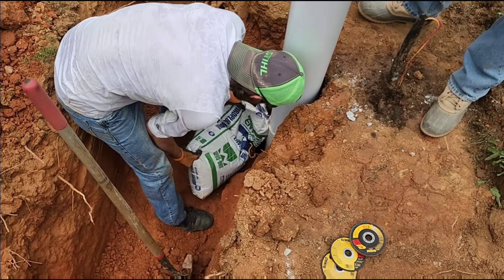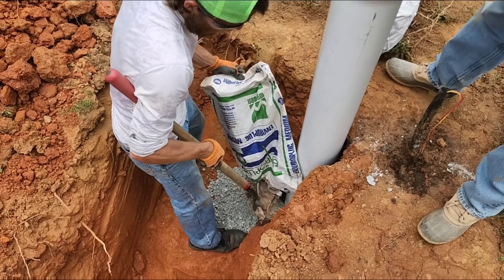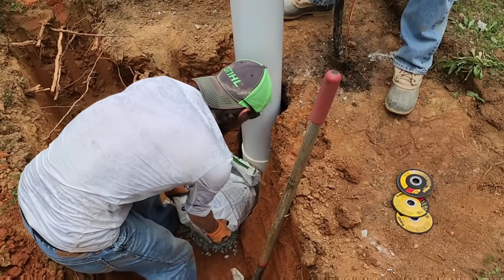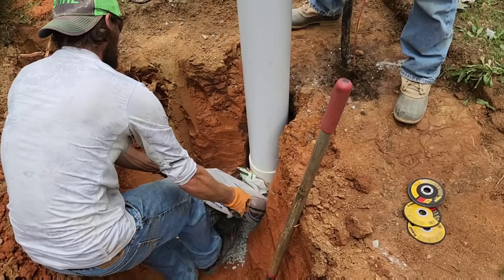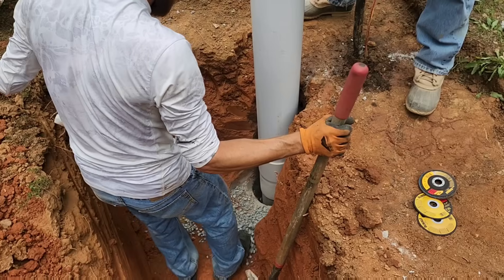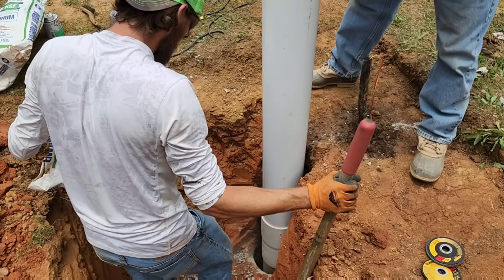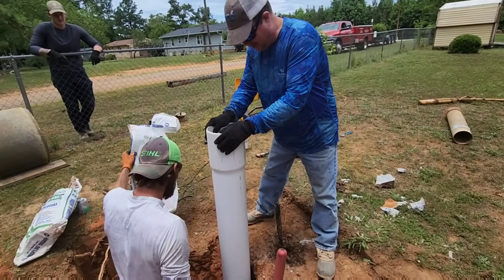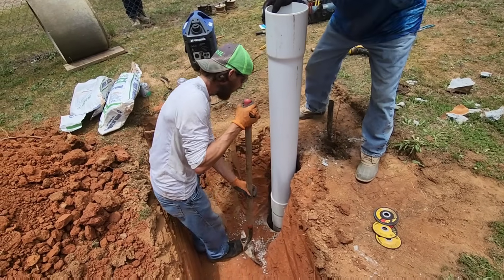So what we're putting in now is granular chipped bentonite. When it gets wet, it's going to swell — definitely going to help. I want you to show this to Mr. Hargrove. Call Mr. Hargrove — I'm going to tell him we need to seal it up. I'm going to go get him right after this. That bentonite tightened it right up — I was hoping when we put the dirt back in there it would help tighten it up. I'm not moving it now — we can't wiggle that pipe anymore because we put the bentonite down there. It's only down there about three feet. We're going to go back to the shop and get four or five more bags of grout so we can grout it all the way to the surface.